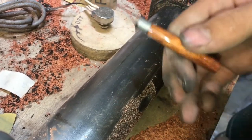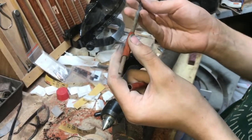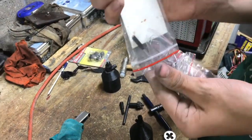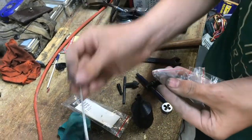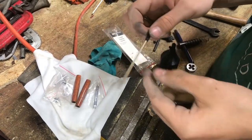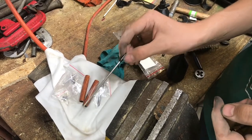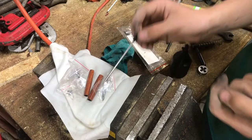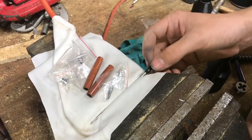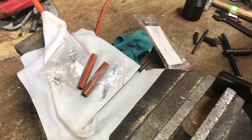I'm going to crack off the bushings on these sides and then sand the edges. It's important that these are clean on the inside — whenever we assemble it, we don't want little scraps of CA glue to make it expand more than it needs to, and it could crack. I'm using a chrome slimline pen kit from Rockler — it was a custom order and I really like it. There have been a few complaints about the slimline kits, one of them being the cartridge that comes with it. So I get the Cross brand refill cartridges. They're about seven dollars a cartridge, which is pretty expensive, but it's worth it because the stock cartridges can only write straight up and down — they can't write at an angle. The pen needs to write just as well as it looks, and for the price point I'm selling them at, they need to write well.